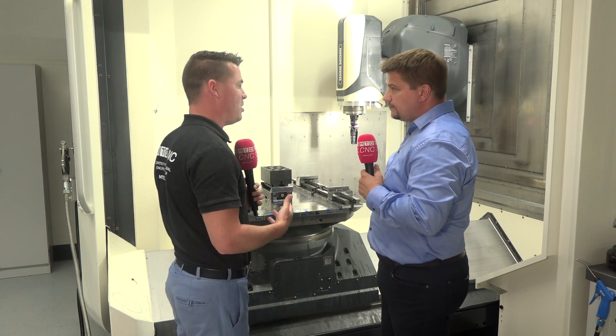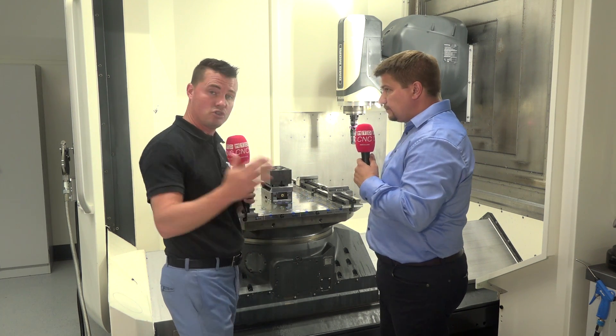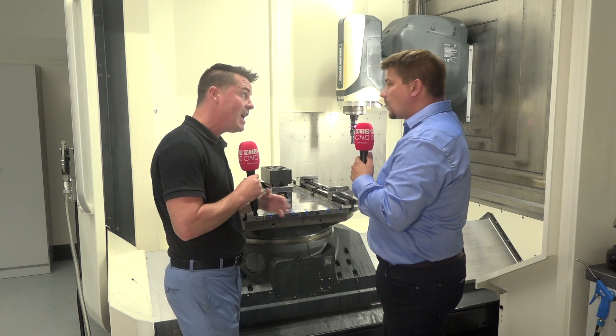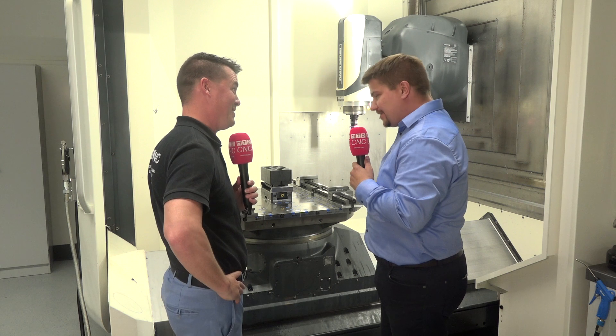Toby and I talk about automation a lot. Right now we're physically using a wrench to loosen and tighten this, but Lang does have an option to turn this into an actuator and use pneumatic air to do the same thing — even if we're loading and unloading with our hands and haven't yet invested in a cobot or robotic system. Absolutely — and the big benefit of a pneumatic system is you can still work manually. In the daytime you can do the tricky work manually, and in the evening hours you set up the pneumatic automation system and keep the machine running lights-out at night without any staff.